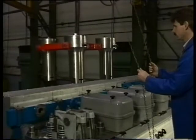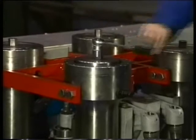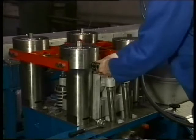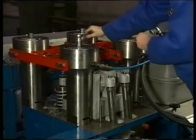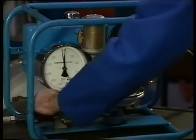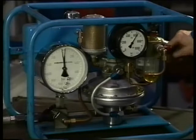Before placing the hydraulic stretching tools, make sure that the screw thread of the cylinder head studs are undamaged and clean. Connect the hydraulic stretching tools with the pump by means of the high pressure hoses. Only two jacks are connected because the other two jacks are linked up. After connecting the hoses, check if the jacks are in bottom position, then turn the jacks back one turn. Close the return valve on the pump. Set the prescribed hydraulic pressure as specified in the instruction manual by means of the reducing valve. The read-off value on the air pressure gauge indicates 10% more pressure than the real value read off on the oil pressure gauge. This has been done for safety reasons.